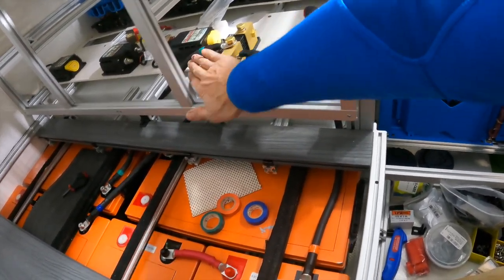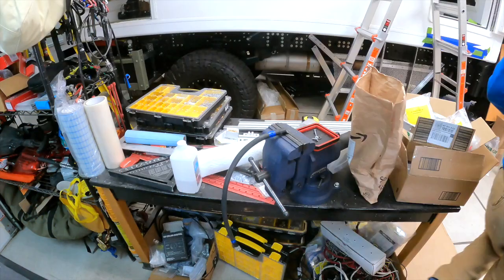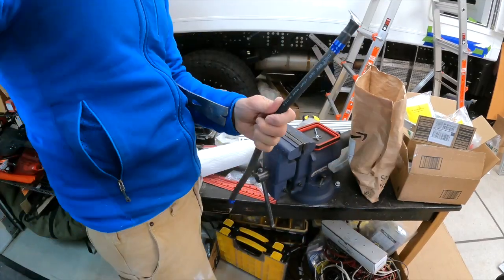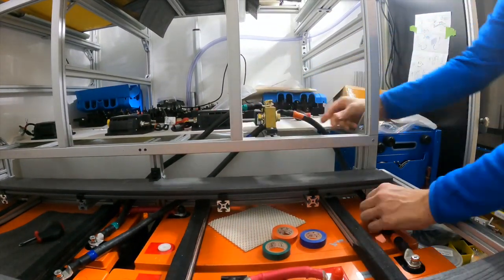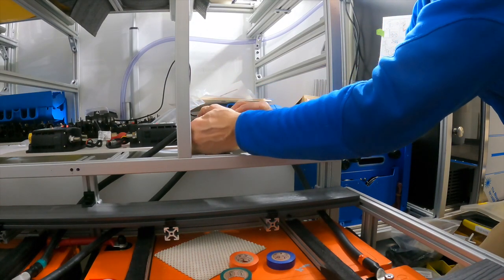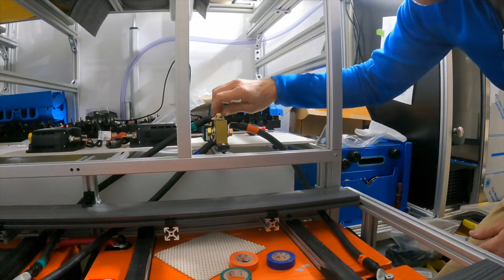I can see a little more of an angle on this wire than I want, so I'm going to give it about a 30-degree angle to slope it down. I'll show you how to do this before you have your wire compressed in a lug, but just in case you already have your wire compressed in a lug like these ones are, one way is to simply take a crowbar or other device and gently push up on the lug only — not the wire — while holding it in a vise. Look at this cable lug — it lays down really nicely right on here.